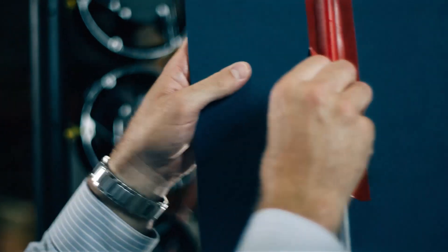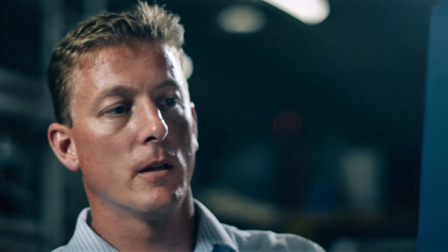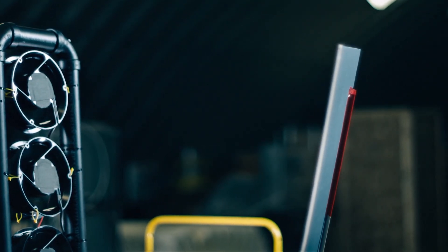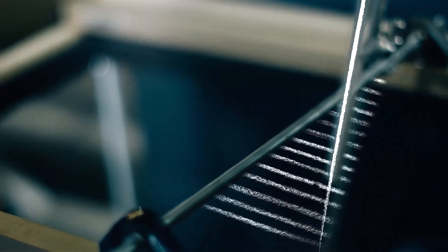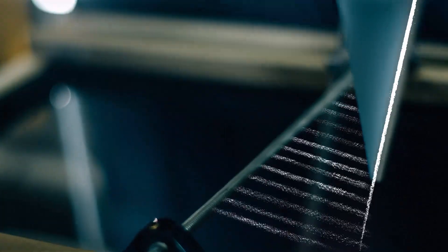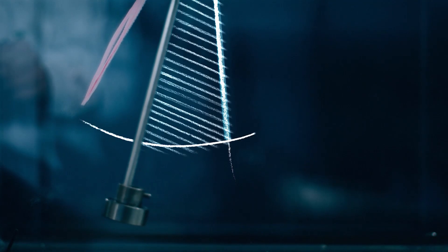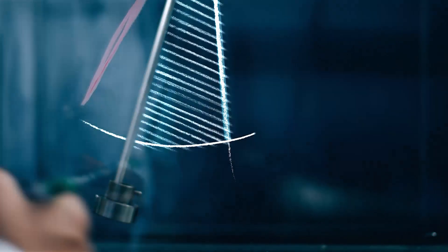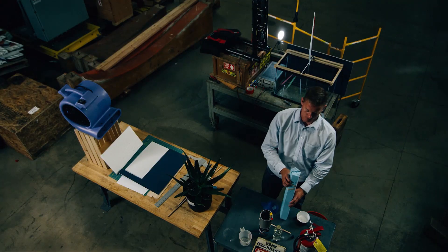Coming back to our experiment, we're going to introduce a very slight design change. Instead of mounting this in the middle, we mount it to the side — this is the key behind the ATB technology. Let's see what this twist does for us in terms of the load. We turn the fan on. What we can see now is the same force of the wind is hitting it, and as a result, some of that load — some of the force of that wind hitting it — is being shed off to the side. As a result, we see a reduction in the angle that this pendulum swings at.